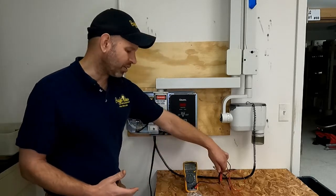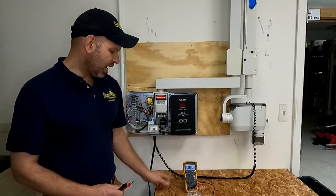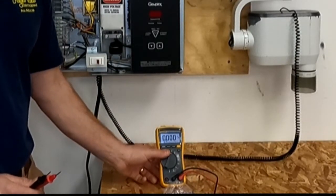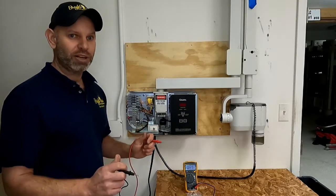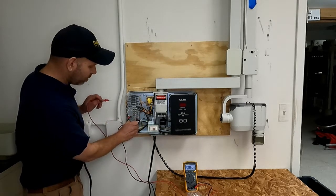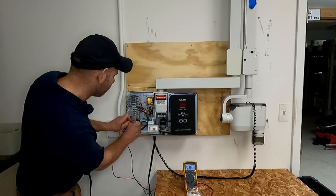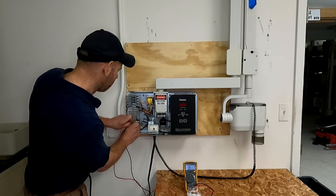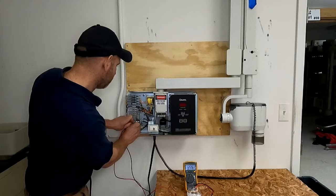To see what the electricity is doing inside the unit, we use something called a digital multimeter. To use the multimeter, switch it to the V with a wavy line — this is volts AC. Carefully, only touching one probe at a time, touch the black lead to the ground, and then touch the red lead where the 115 volts are coming in. That number is going to jump up — right now I'm seeing 122.6 volts. This confirms power is being applied through the system to the switch.